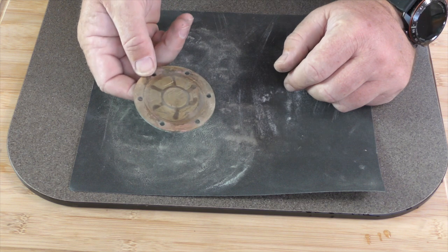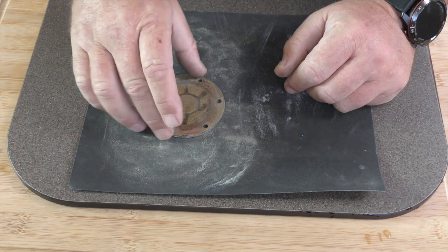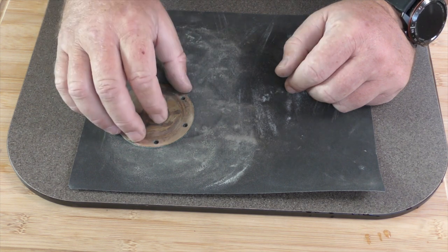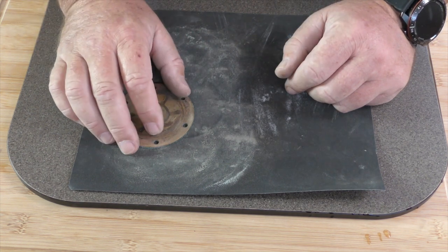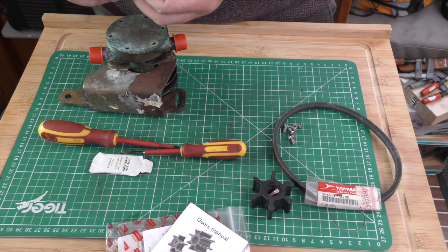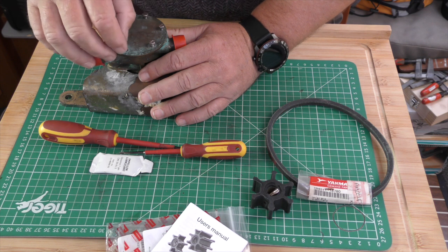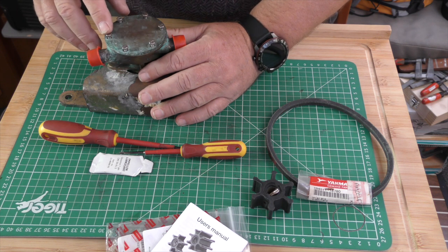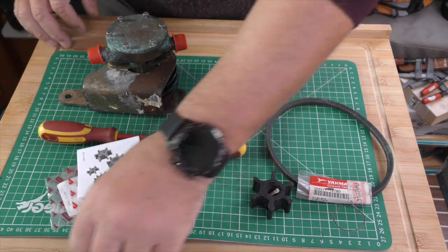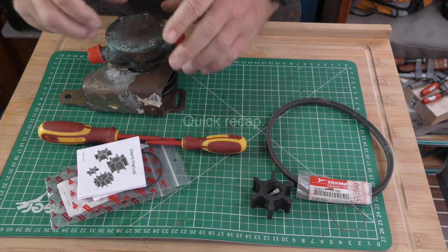That can go back onto the pump, and as I say, we won't put the impeller back in because we don't want to damage it, but we will make it so that the impeller with the pin are there on the pump, ready to swap over with the O-ring should they be needed. And then if your bolts aren't worn, just pinch them up and then do the last little bit just to pinch them home with a wrench or a spanner, and Bob's your uncle, as they say.